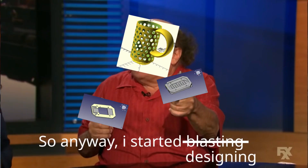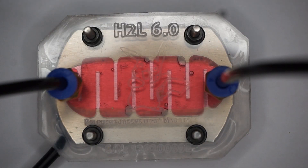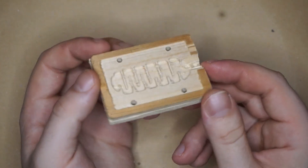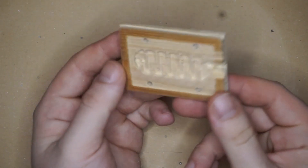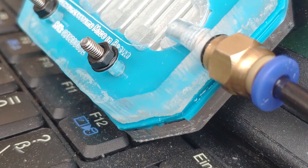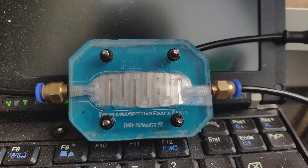So I started designing new modules. I used 10 mm and 5 mm acrylic plate to sandwich the LED. To improve flow area over the heat source I decided to add some snaking. I also made some test modules from wood because when I did the first design I didn't have acrylic on hand, just to try out if my mill could do the snaking — and yeah it works, but I don't think the wood would be watertight. When I installed the first modules with my beta tester, he noticed that side-feeding modules now create a huge cable salad since I changed the fitting diameter to a smaller one and now had the modules running in parallel so water flow would be better.